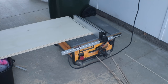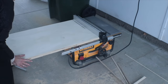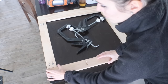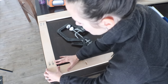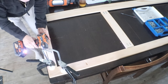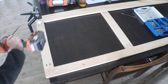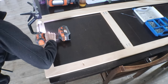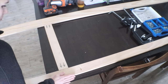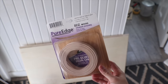There are certain hinges that work with beveled doors, which was my initial intention, but later on you'll see which hinges I ended up using to match the vanity. To create the face frame of this closet I'm using select pine — I ripped some of them thinner. The side covering the framed wall is kept at three and a half inches wide; the others are at two and a quarter inches wide. I drilled a ton of Kreg jig pocket holes and put the frame together with some clamps, making a sturdy joint very quickly. There are also Kreg holes in the skinny piece that will be screwed into the wall stud near the door.